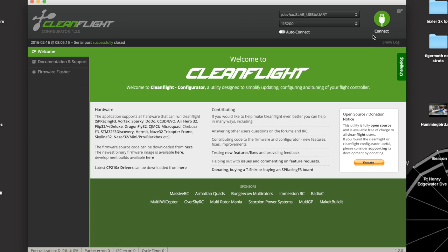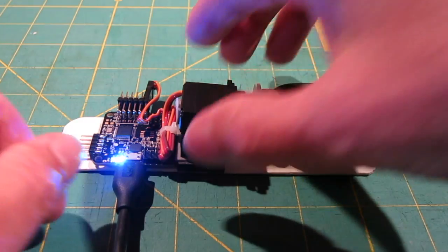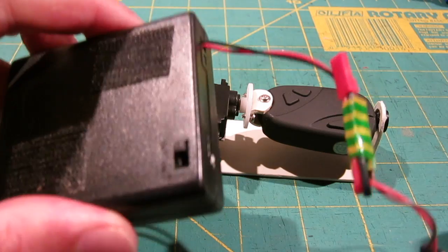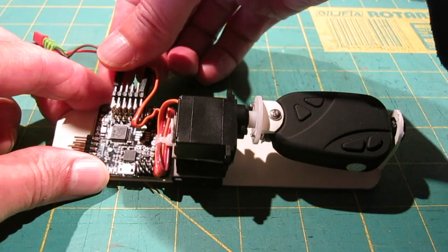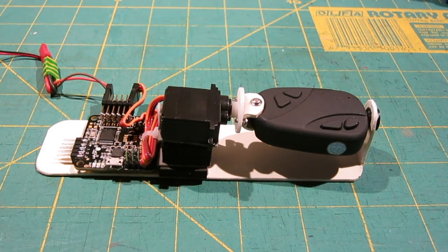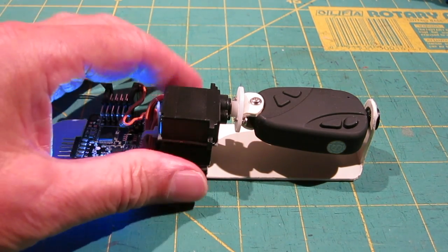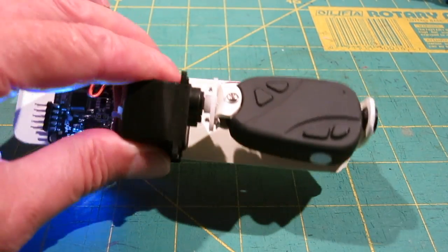Save again and you should be good to go. Disconnect. Now that it's configured, I can disconnect from the computer and plug in 5 volts into one of the servo positions - 5 volts, not 12 volts. You'll blow the board if you put 12 volts in there. Now if I turn it on and let it stabilise... there we go, quick beeps, and that should be ready to roll. Nice and stabilised!